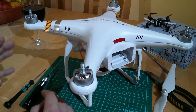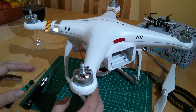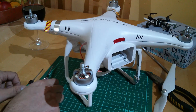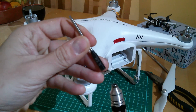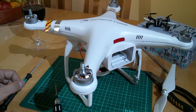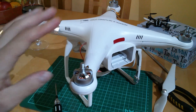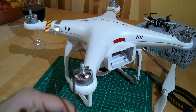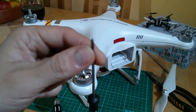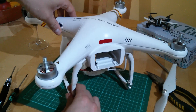Less often — probably once a month or more often depending on flight frequency — I like to take the top off and have a look inside. I've already done a video about that, I'll put a link below. The tools you'll need are a 2mm hex driver — not a very expensive one but one with nice sharp clean edges so you won't strip any screws. There are also four little Phillips crosshead screws on each arm; people have reported stripping those. The DJI screwdriver provided in the case does not fit — don't use it. I'd recommend buying a reasonable quality Phillips size double-zero screwdriver.